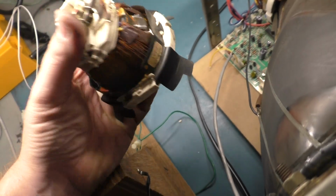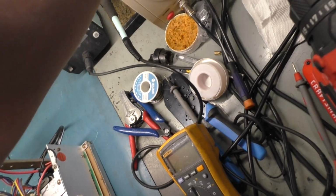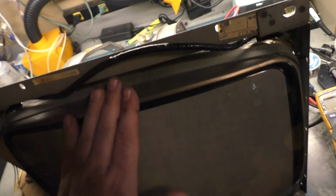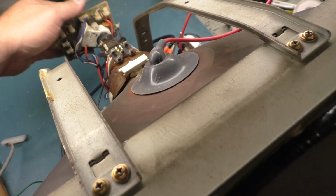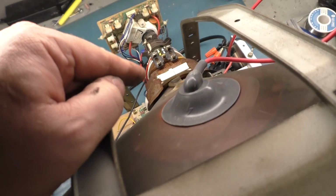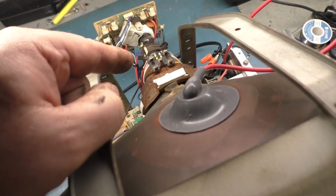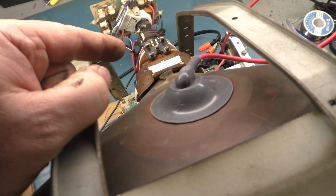So my game plan to see how well you'd be able to just slave on a 7000 with a factory 1801 yoke is not going to be able to be shown, because this yoke is a goner, just like the first one. So both yokes from both monitors were bad. Imagine that. Number one failure on these 1801s is the yoke. So I grabbed the second K7000 that I had from the stash, and I robbed a 7000 yoke from a tube that has severe turbo outrun screen burn, and that tube I can use as a test tube now if I need to in the future.